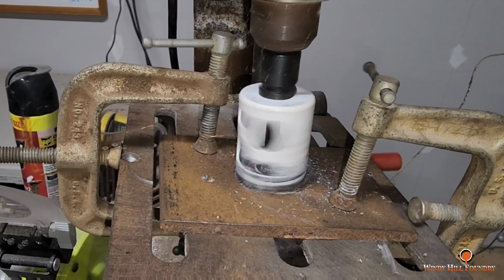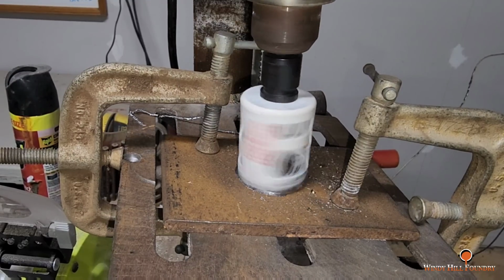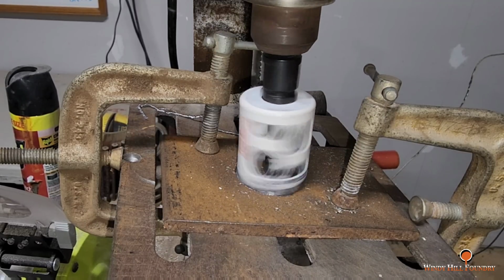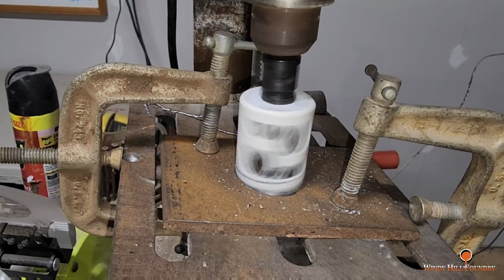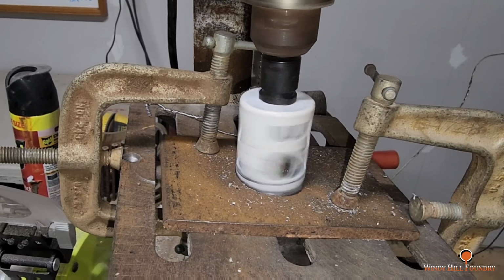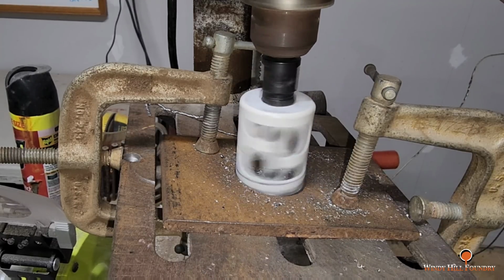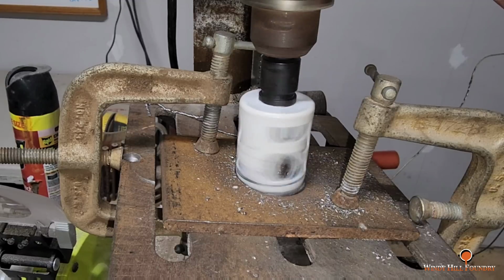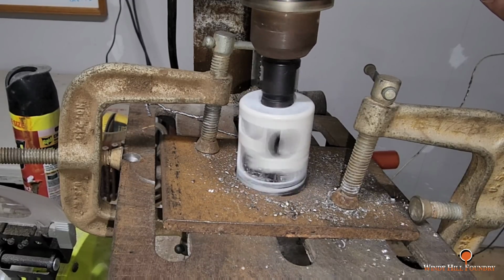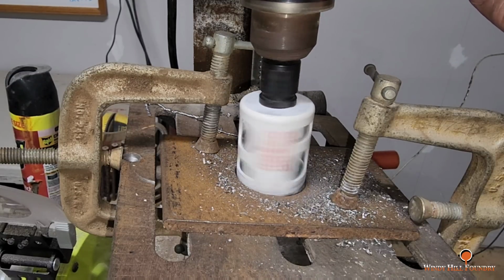But this plate is going to be formed. It's going to be curved to a radius to fit around the side of a brake drum, which we're going to use for the base of the furnace. The furnace will be able to accommodate up to an A6 crucible, which will be ideal for her, I believe. And I will show you more on that here in a minute. But yeah, this thing, after it got about 2/3 of the way in, where it was getting 90% to 100% cut right before it goes through the other side, started doing really well.